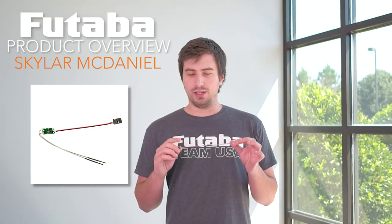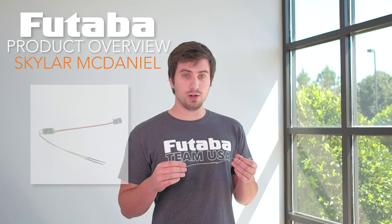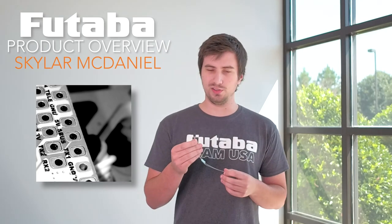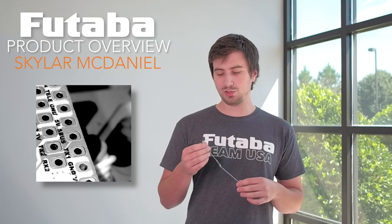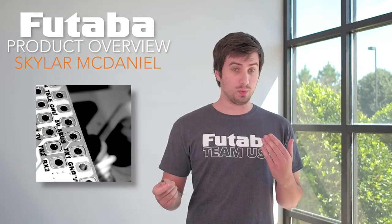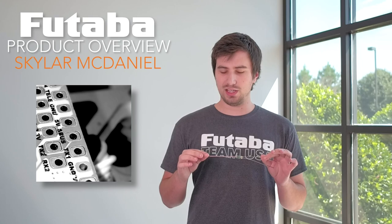For the most part, all you'll really need once you're setting this up is an inverted UART or an S-bus pad on the flight controller. It's pretty simple wiring, just 3 wires, or if you want, you can use the included J connector and solder that directly to the flight controller, so it's easy to plug and unplug between the two if you ever have to swap receivers, swap quads, and just want to keep the same receiver. It's one of the main advantages that you can get with this.